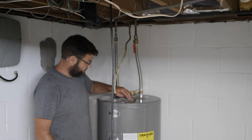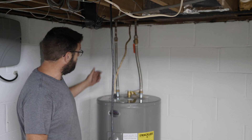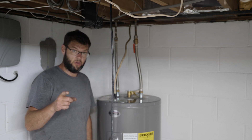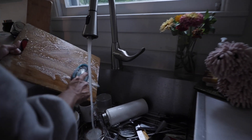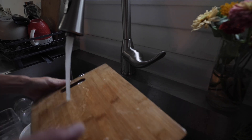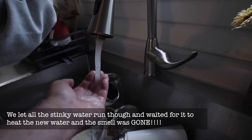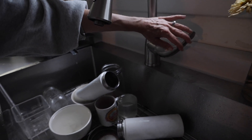After fighting to get that bolt out, yanking this thing all around, cutting the rod off, and almost cutting my fingers and the cord, we finally got it back on. I'm filling it up with water and I don't see any leaks — the water stopped running so we should be good. The ultimate test: does the water still smell? No smell at all, not even the slightest. After changing out that anode rod and letting new water heat up, it's gone. If you've got this problem, check your water heater and change the anode rod — it's definitely worth it.